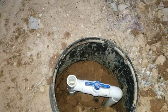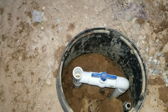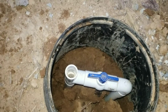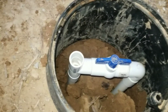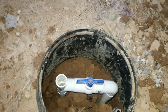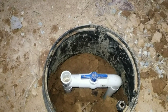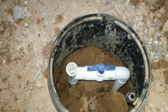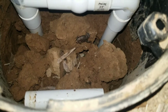If you are building a pool or in the process, stay tuned for the follow-up video. I don't know exactly what hydraulics process this is — it's kind of like a sight glass in a boiler, as best I can say. I glued all that together but left those couplings apart so during the summertime I can raise the pool level a little higher on the skimmer, and in winter I can take those off and have it halfway down. The valve is there just in case I want to temporarily raise or lower the water.